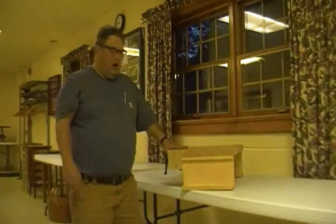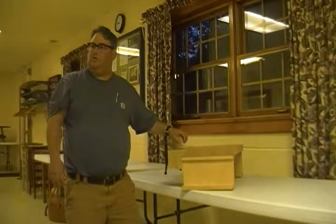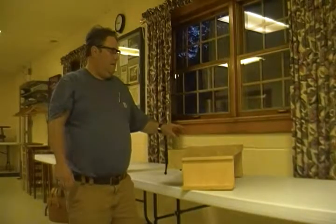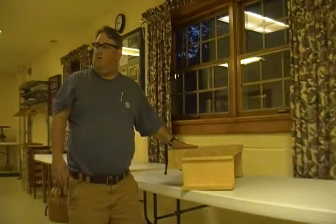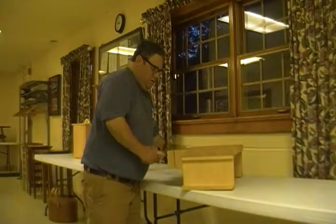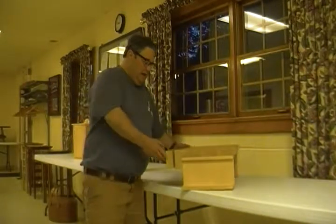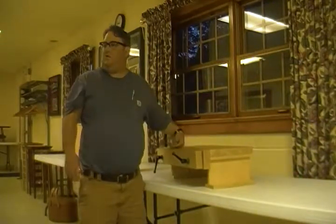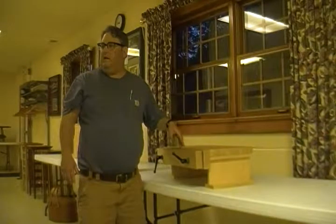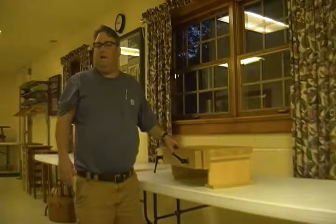The vise jaw on the front end is cambered a little bit, so it's a little looser fitting in the ends than in the middle. So when you clamp down on the screws, the vise bites a little more in the center before it's tight on the edges, which is nice, because if you're not using a full width between the screws, it will hold pretty tight in the center. I believe it's 18 inches between the screws, so it's big enough.